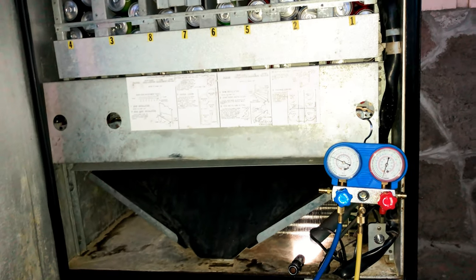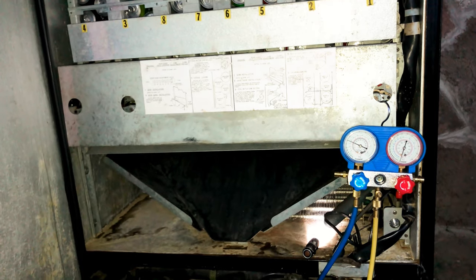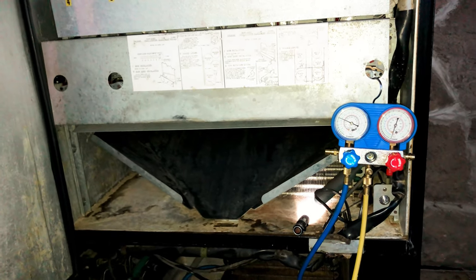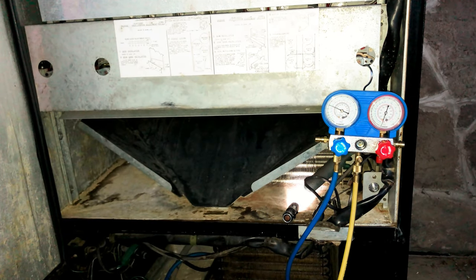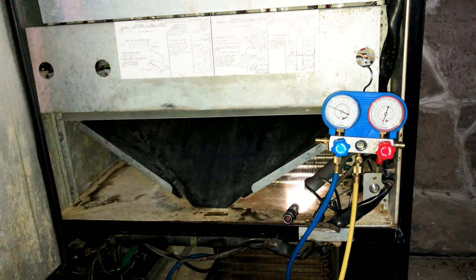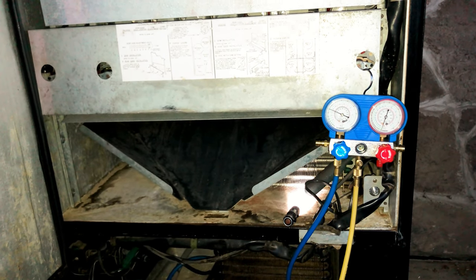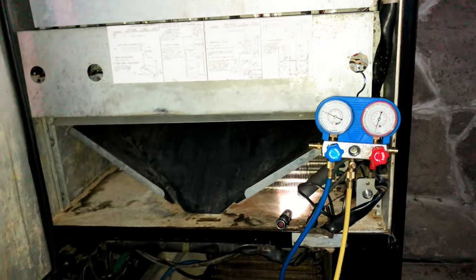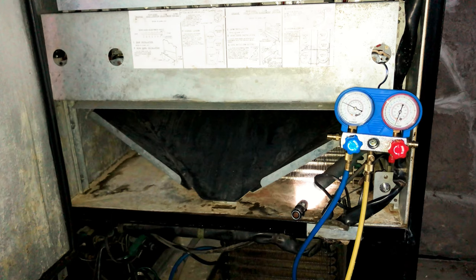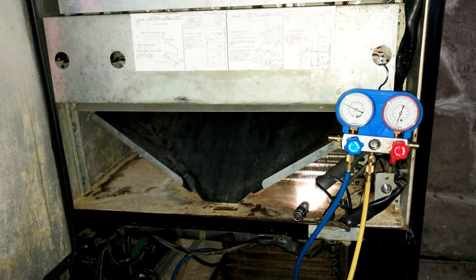What is FrostyCool? Well, in actuality, it is a mix of propane and isobutane. Yes, flammable, but if you think about it, even R12, which is considered non-flammable, is mixed with the oil in the compressor. If you had a high-pressure leak spraying out, guess what? That is flammable with all that atomized oil. Same with R134A or R410A, all of them. Once you atomize the oil in with the refrigerant, it is then flammable.